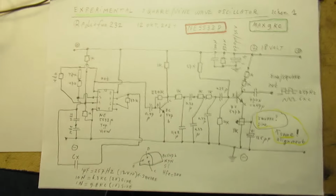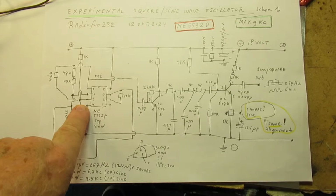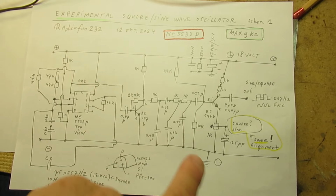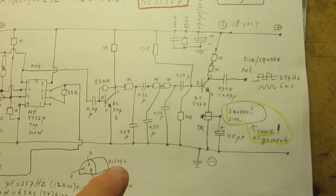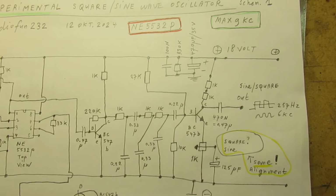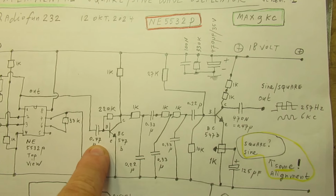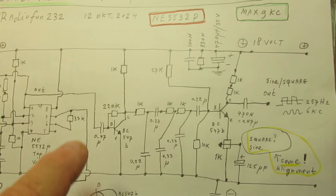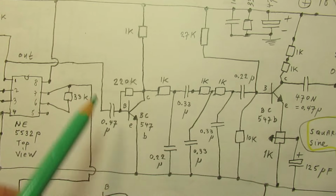But the interesting part is perhaps that we here have a squarewave oscillator and here a filter that changes the waveform from a square wave to a sine wave. And here we have two extra transistors that do their job. This one is amplifying and this one is also amplifying, and I've talked about this circuit a few days ago,